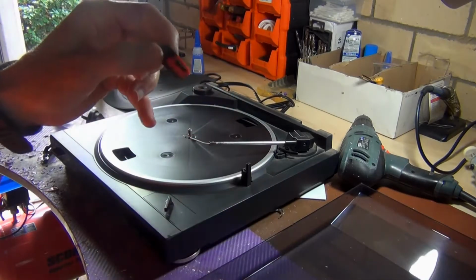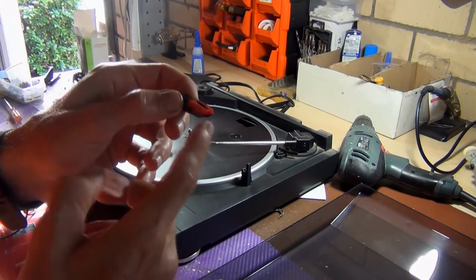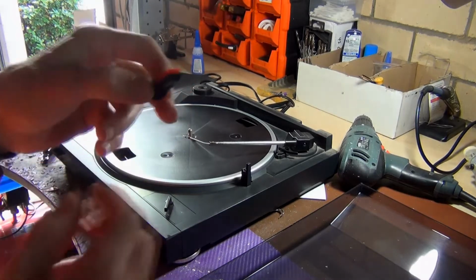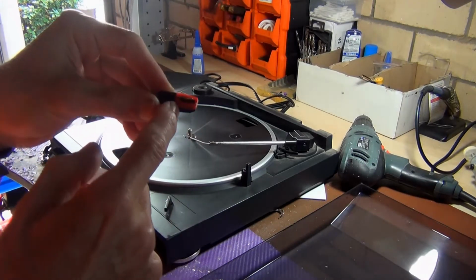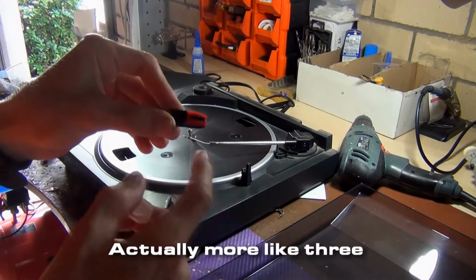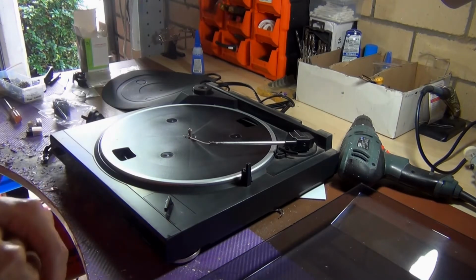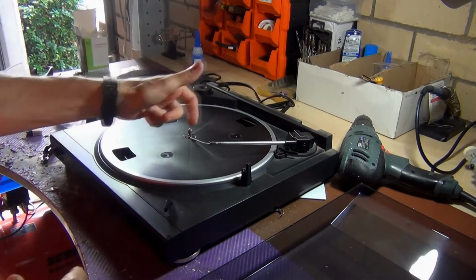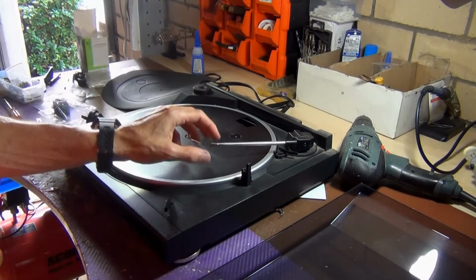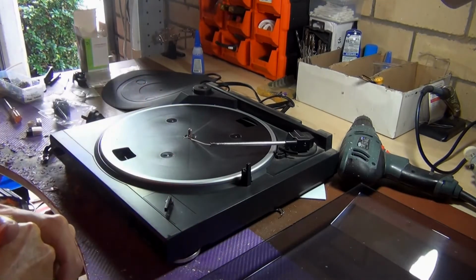So just these ones, and when this cartridge piece fits into the head shell, it'll be locked in there. I'll make a little connection here and a little sliding section here and lock this in, and what you can do is just remove these orange pieces, and you can buy like 5 of these for about $10, and I don't want to keep having to pay $30 for replacement stylus. And I'm going to put this up on Thingiverse. If you have a turntable like this Optimus turntable, it has this post here designed for that. But you can modify the Thingiverse design, of course, if you want, to adapt it to yours.